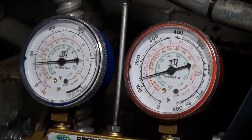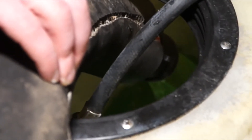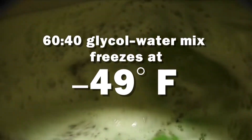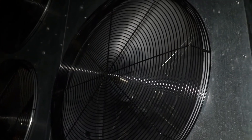This is the chiller that makes the ice for the Gateway Playhouse ice show. These are compressors, these are pumps, and this is the barrel where all the glycol recirculates. Glycol is just a fancy name for antifreeze — it remains liquid at 11 degrees Fahrenheit. This is the condenser, which gets rid of all the heat taken from the mats inside and brings it outside into the air.